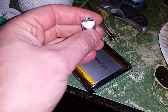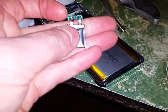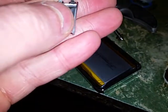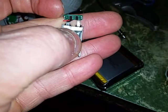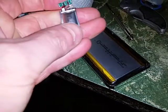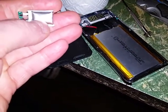With a lot of these batteries, you'll think they're fine, and it's just a bare battery. What you'll see is they've got this yellow tape wrapped around this little charge control chip, or whatever these two things are here. Two little chips, a resistor at that end, and a resistor and what looks like a ceramic next to it, where my fingernail is. Whatever the hell that is, it didn't bloody save it. That was out of this one here: 3.7 volts, 90 milliamp hour, or 0.33 watt hour. So that was the end of that, and I couldn't get any charge out of it.